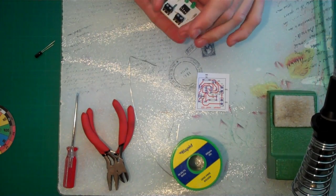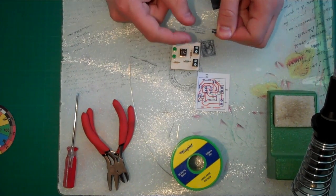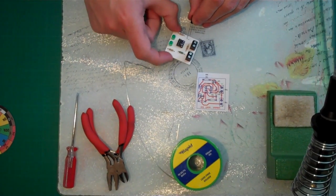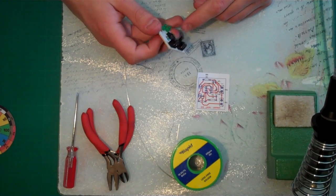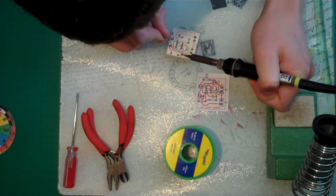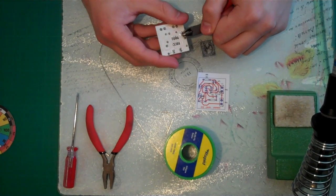The final component is the capacitor. We can see a little plus on the diagram — the long leg of the capacitor is the positive and the short one is the negative. The other way of checking is there are little negative symbols and a white band usually on an electrolytic capacitor which indicates the negative. It wouldn't matter which way you put it in if it was a non-electrolytic capacitor, but because it is electrolytic it does matter. So we place that in, solder it up and cut the component leads.